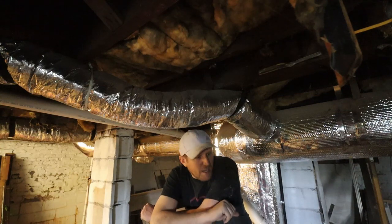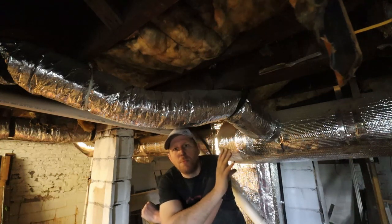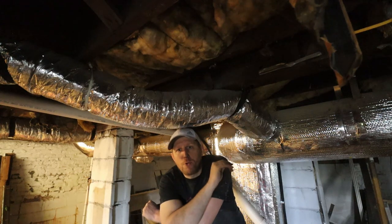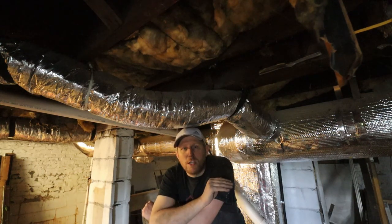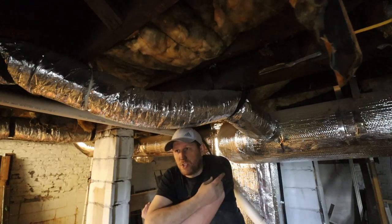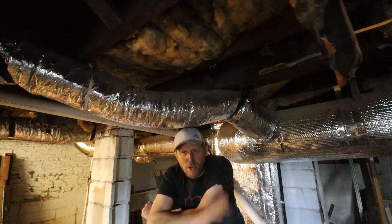So what does it mean, sizing? Well, you shouldn't just have the same size tube running everywhere. The tube needs to be at the right size that each room gets the appropriate amount of air, because you want each room to be comfortable and not have cold spots, hot spots. So you will pay more probably for a good contractor because they do a calculation.